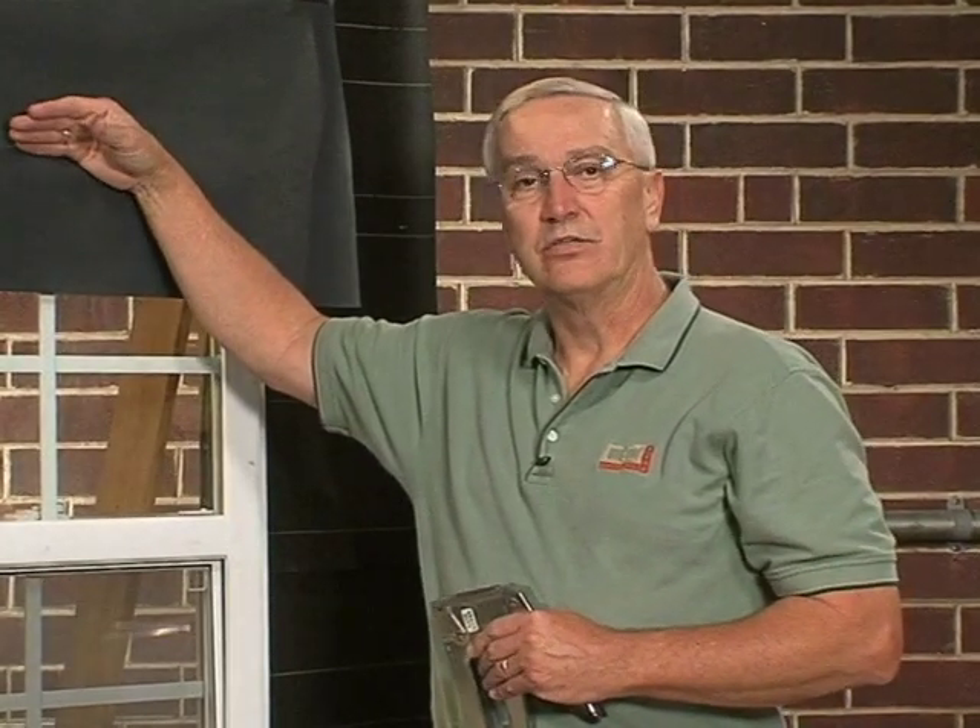It's very important to get the water out as quickly as possible, because any water that lays behind the wall could contribute to mold growth in some way, as well as brick staining and different types of stains. So the quicker it exits the wall, the better.